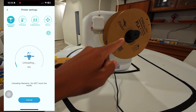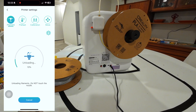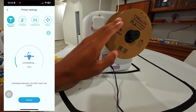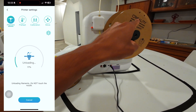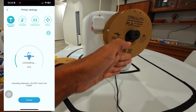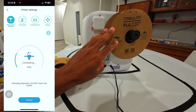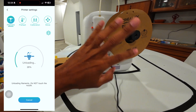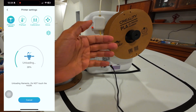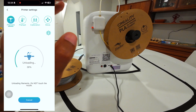I'll leave a link to the bearing spool in the description — it's an $11 part. If you don't use a spool with bearings when using third-party filament, like this Creality PLA, it's gonna jam and get stuck, and you don't want that. The bearings will just have it spin naturally. Using the XMaker AOC filament you'll never jam, but because the third-party spool is cardboard and not plastic, it just gets stuck. Thanks to the bearings, you won't have any problems.